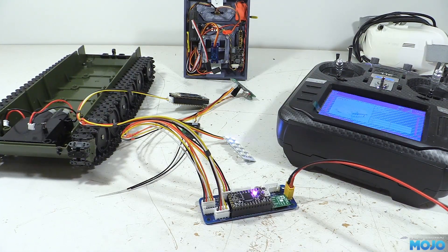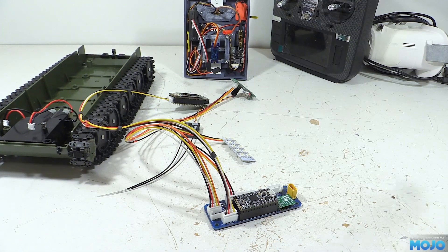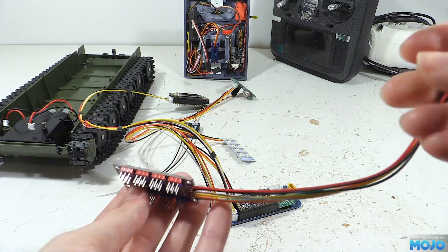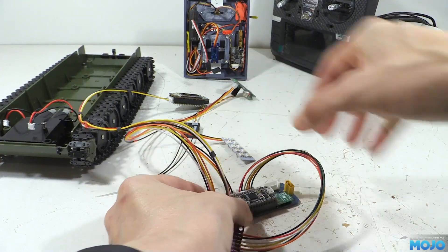The next module hasn't got any firmware to drive it just yet, so I'm going to turn off the system. It's an off-the-shelf LED driver with 24 outputs. I've used the same board on many other projects. The good thing is you don't need resistors as each output is constant current and you can set the brightness individually — ideal for things like brake and tail lights.